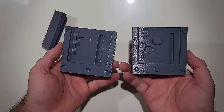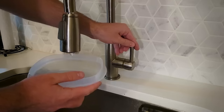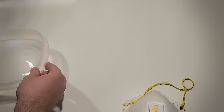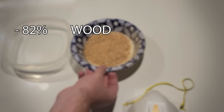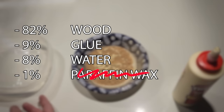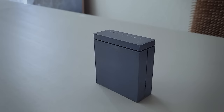I started by making a little mold with various subtractions and additions to the walls just to see if there would be any problems. For the mixture filling the mold, I wanted to use items everyone has so they could try making their own. I made it as close as I could to how MDF is made — generally 82% wood fiber, 9% glue, 8% water, and 1% paraffin wax, though I'm kind of ignoring the wax since I don't have it. I stuffed that into the mold and came back in 48 hours to see how it turned out.